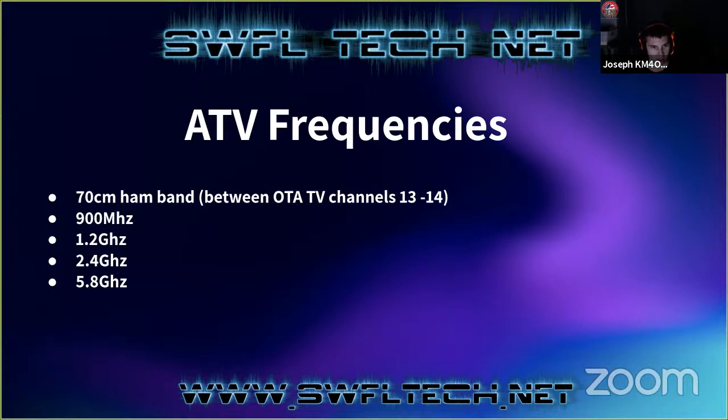And it can actually be tuned to using a normal television tuner. They're not so common anymore, but back when people used to put up their VHF Yagis and UHF Yagi antennas on the roof to pick up signals, you can actually use the same little TV receiver boxes to get your own little transmissions, which is kind of interesting. Next up, these are the most common frequency bands. When you're buying equipment, you can only really find equipment that transmits video on these bands, and the second lowest one is 900 megahertz.